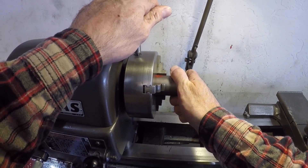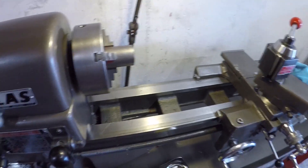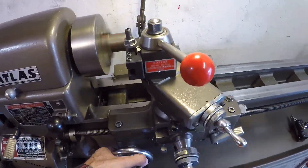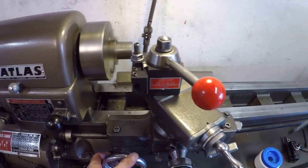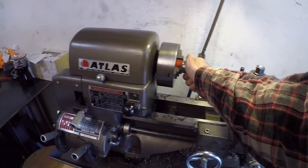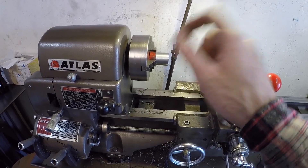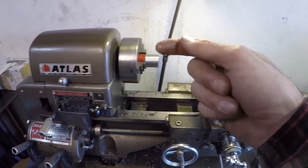What I usually do is loosen it a little bit and give it just a spin to make sure that it's actually straight in the 3-jaw. Then we'll face that off with a turning tool and a parting tool. I've got about 10 thousandths left to take off before I'm at final diameter, but this piece is now warm to the touch from machining. If you measure it warm when you're doing a press fit, the tolerance is critical — measuring it warm will cause you to miss your goal. So I've got to wait for it to cool off, then I'll machine it to final diameter, drill it, and part it off.